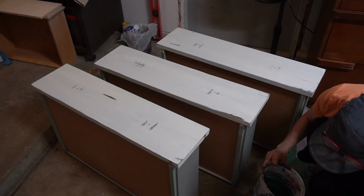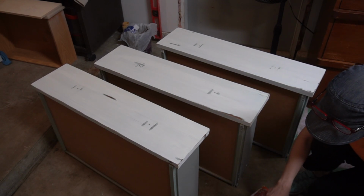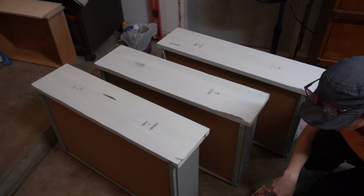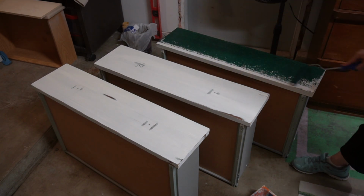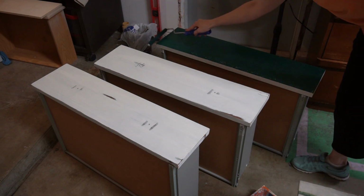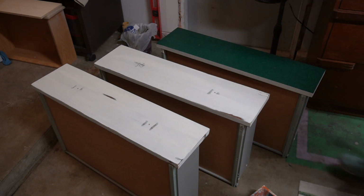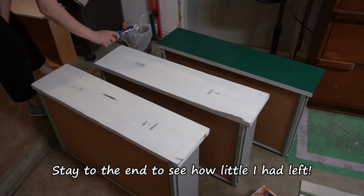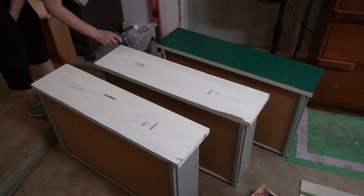To give the top a bit more time to dry, I started with the drawer faces. I was super psyched that these are totally flat. It made my job a whole heck of a lot easier. What didn't make my job easier? Not priming first. Don't ask me why, but I completely flaked on getting a gray or another dark color down before jumping in with the green. Fortunately, I had enough paint to cover everything. Unfortunately though, it took 3 coats to get full coverage.